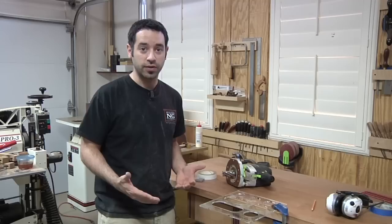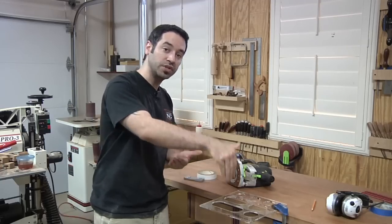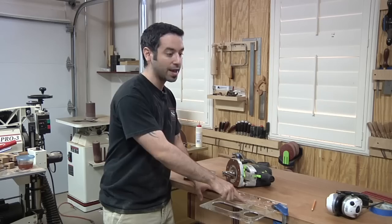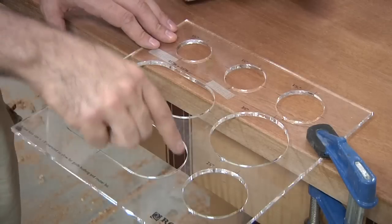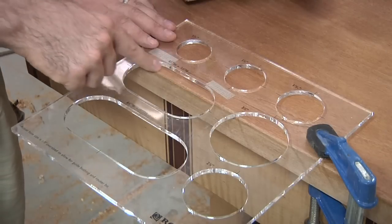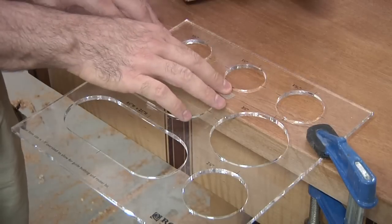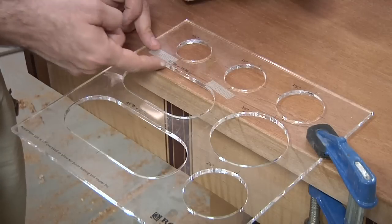Although I'm not too worried about cable management with this particular project, I do want to make sure that cords going back down from the top of the table to the PC have a place to go, because I really do want this thing to be right up against the wall. This plexiglass template from Rockler has come in handy so many times for various things — having perfect circles and elongated circles just comes in really handy for projects. I've set this one up to give myself about a four to four-and-a-half-inch area where the cords are going to be able to go through. I've got it double-stick taped to the surface with my pattern bit ready, and I'm just going to take a few passes to slowly remove the material until I get my bearing up against the plexiglass template.